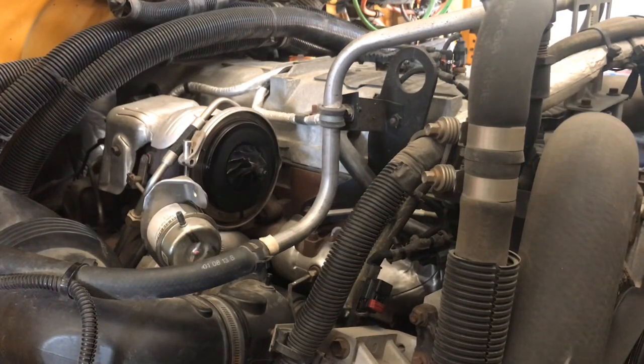If nothing comes out as being bad further up on the system, then more likely we're going to have to replace that upper turbo assembly. But right now it looks like the oil's coming out from either a clogged up engine breather, or maybe this unit's air filter never got changed, who knows. Let me go through it and find out what the hell's going on with this one.